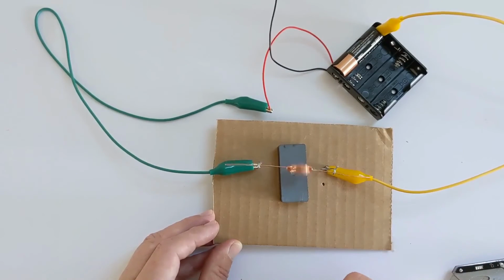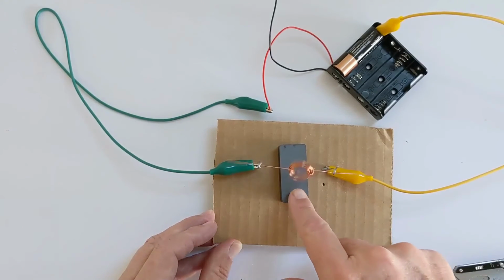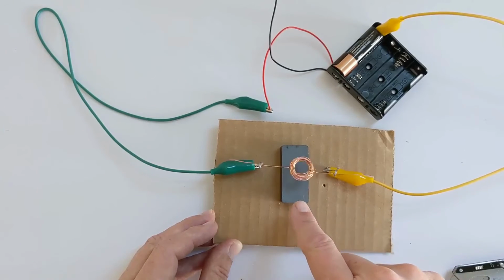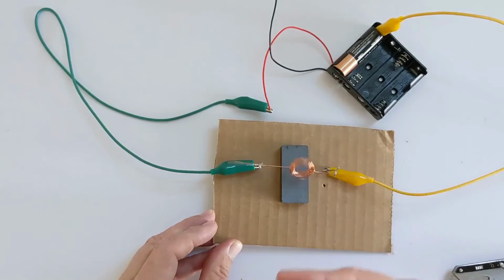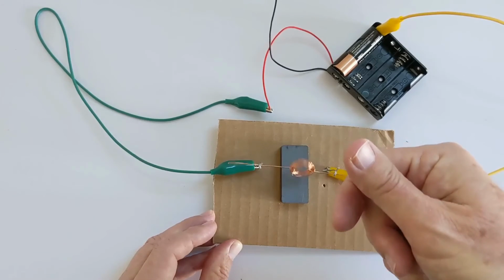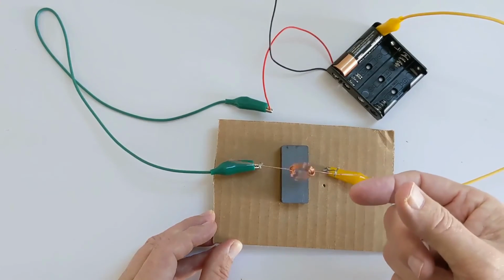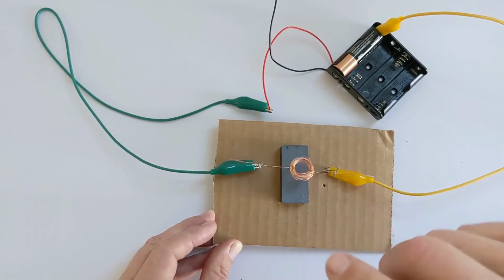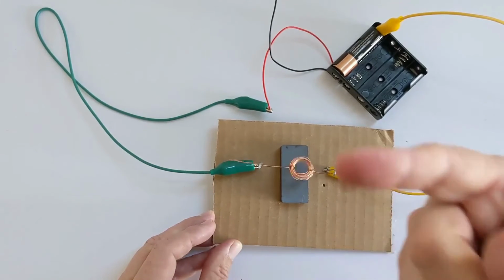So this little magnet in the middle is constantly turning back and forth between being a magnet, now I'm a magnet, now I'm not. Now I'm a magnet, now I'm not. Since this magnet on the bottom is permanent, it will repel exactly when this thing is a magnet and push it. As soon as it gets all the way around, if the magnet didn't stop being a magnet, then it would just get stuck. Just like two magnets, you've reversed the poles, now the magnets are going to come flying together and it would stop turning. So we turn off the magnet and let it coast.